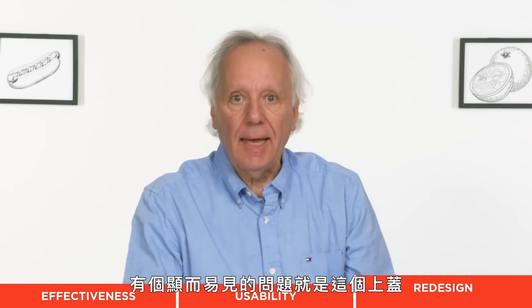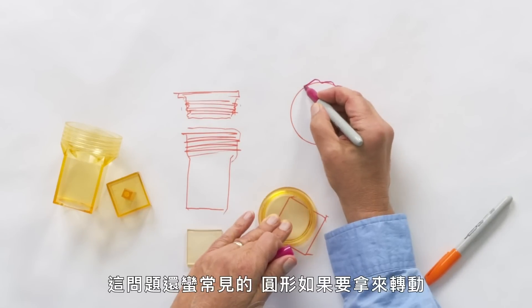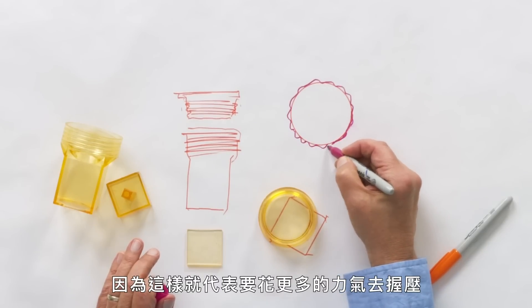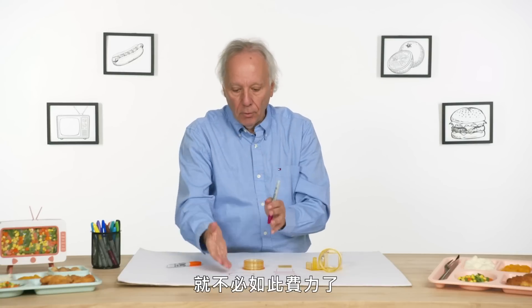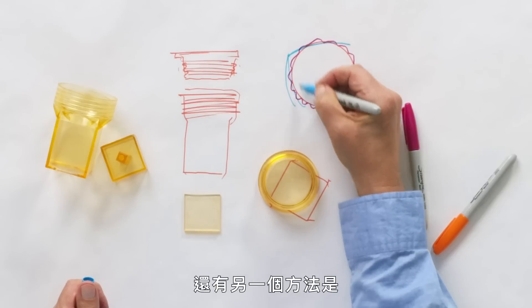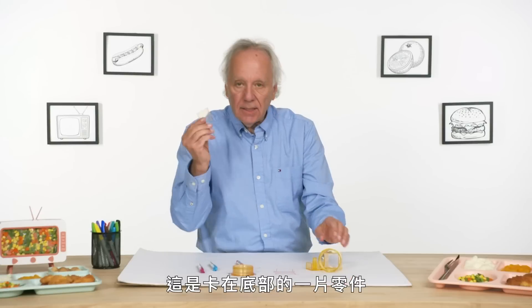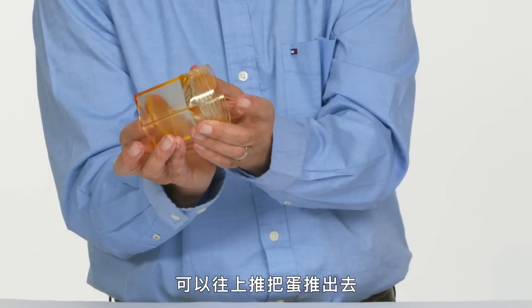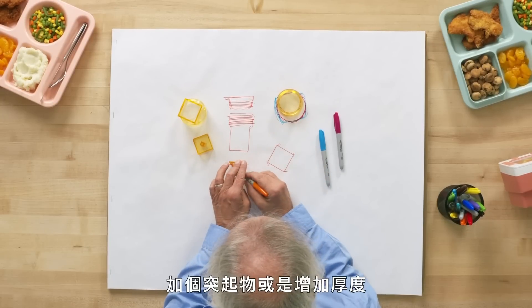One thing obvious to focus on is the cap. I think it's a little too slippery, a little too round. I would at least give this a little bit of shape to it. Round shapes that have to be twisted shouldn't be perfectly round, because what that means is you're going to have to squeeze that much harder to compensate for the mechanical advantage you would have from fingers fitting into a groove with friction. Another way to do this would be to make it a very soft square instead of perfectly round. I think we can add a little bit of shape or thickness to the bottom push-out piece.